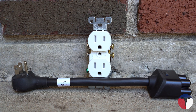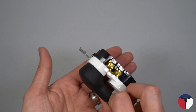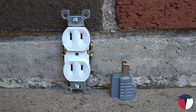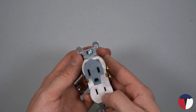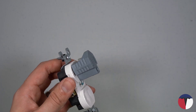The NEMA 5-15 outlet is the standard outlet used in most North American households. Every Tesla Mobile Connector comes with this adapter. If you lose your adapter you can purchase another one from Tesla's website for $35. The 1-15 is an old, deprecated receptacle that functions identically to the 5-15 but lacks a safety grounding pin. The only way to charge your Tesla with a 1-15 outlet is a 3-prong to 2-prong adapter and attaching the ground tab to a proper ground — I highly do not recommend doing this.